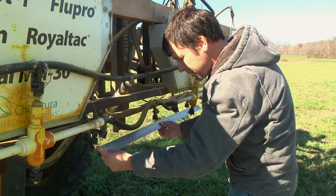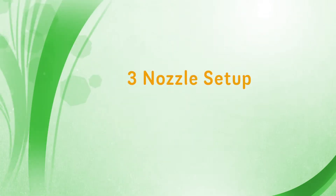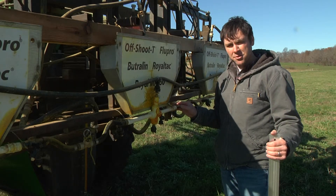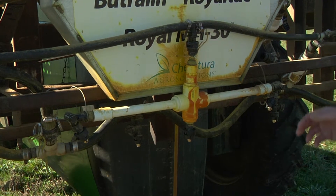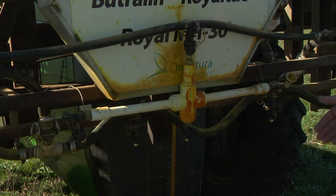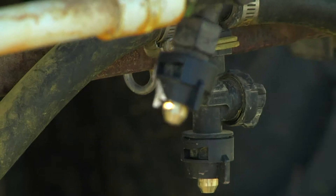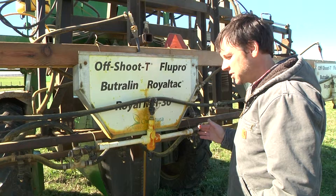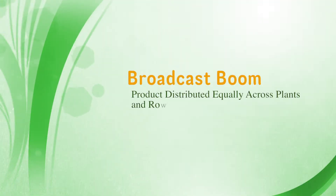The first step is to measure the nozzle spacing. On a broadcast boom this will often be 18 to 20 inches. If you're not using a dropline, the most effective way to control suckers is a three-nozzle setup: a center tip, usually a TG5 or similar full cone nozzle directed at the center top of the plant, and two smaller tips — usually TG3 full cone nozzles — tilted in at an angle at the top of the plant. This arrangement directs most of your product to the top center of the plant, resulting in better sucker control, whereas a straight broadcast boom delivers an equal amount of product on the row middles as well as the top of the plant.